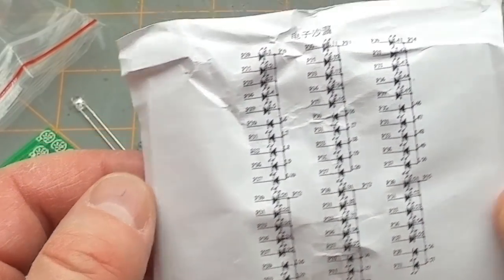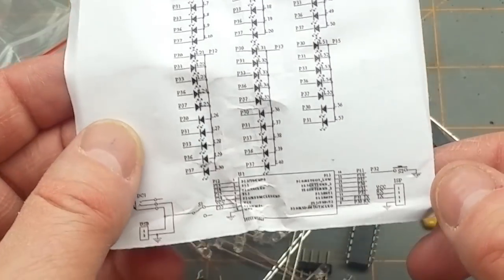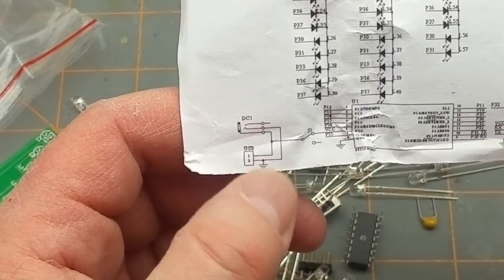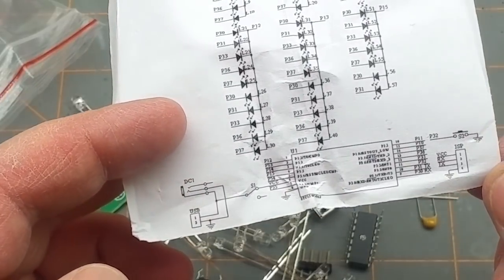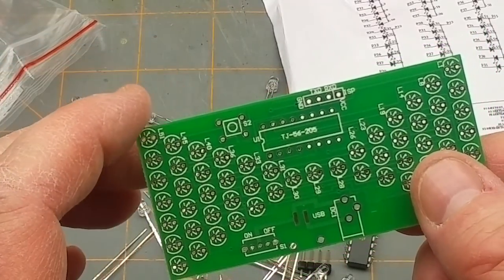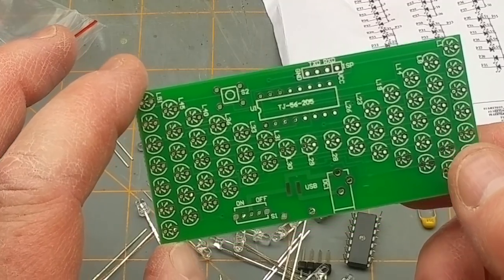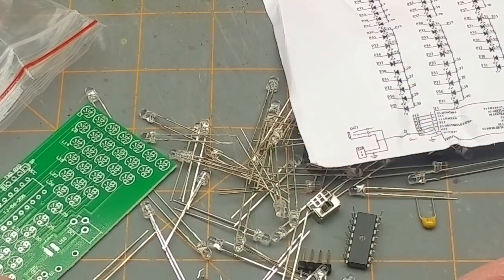So what we have here is five series strings of LEDs for one size and one of a different size, just connected to the pins of the chip. Power in — it claims to have a USB power socket but I'm not seeing it. It's got receive and transmit, data, VCC up there, and ISP pins. So mostly it seems to be just blinking the LEDs in patterns. Let's check the listing to see if it says anything more — I remember buying something like this but I don't remember exactly what it does.